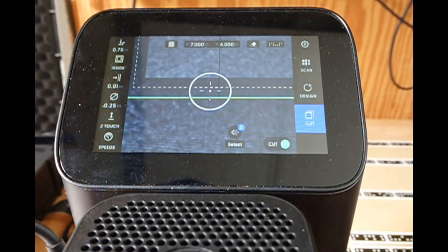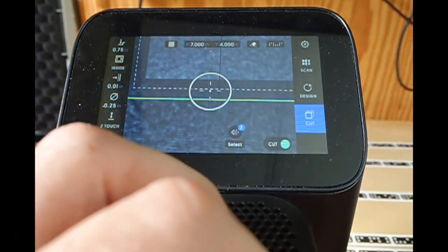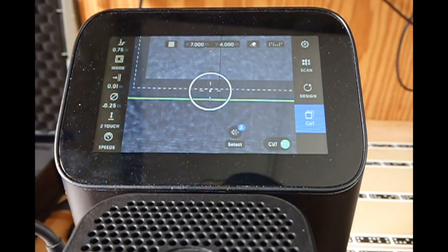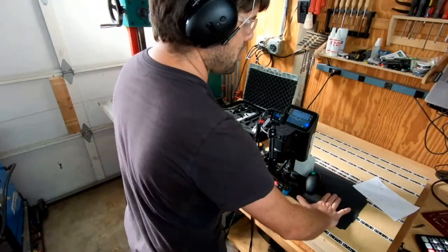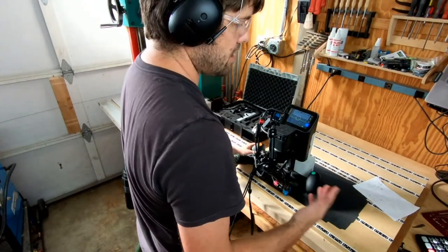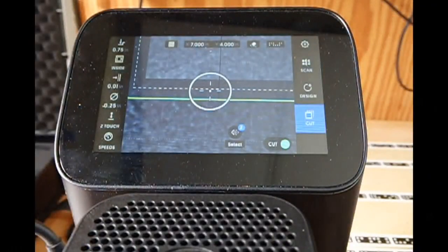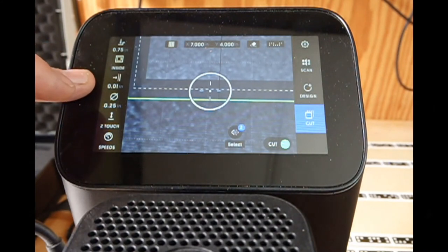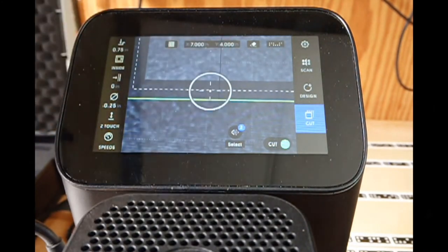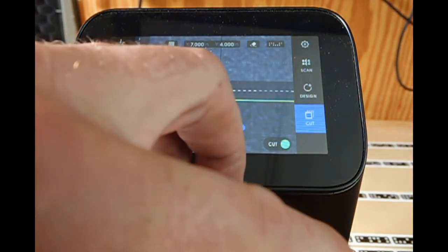I'm cutting on the inside of this line using the stock cutter with a tiny offset, and I'm going to go to the full depth — 0.75, which is three quarters. There's a preset down here which is super easy to click. I'm using an up-cutter so it's going to extract all the chips, and I'm actually slowing down the spindle to about four or four and a half. I don't want the foam to melt — it's actually quite resilient and forgiving to cut. We're doing a roughing pass with a slight offset — actually I'll just do a finish pass since it's spongy and quite forgiving.